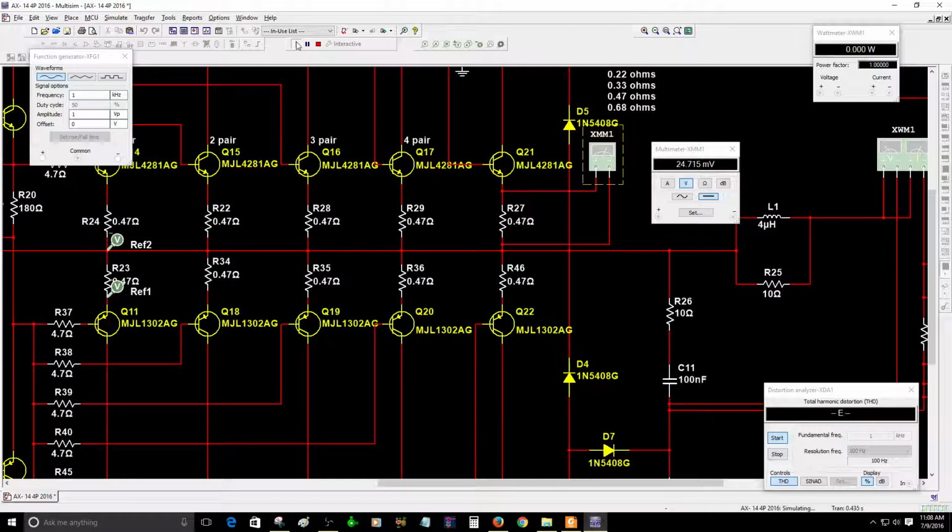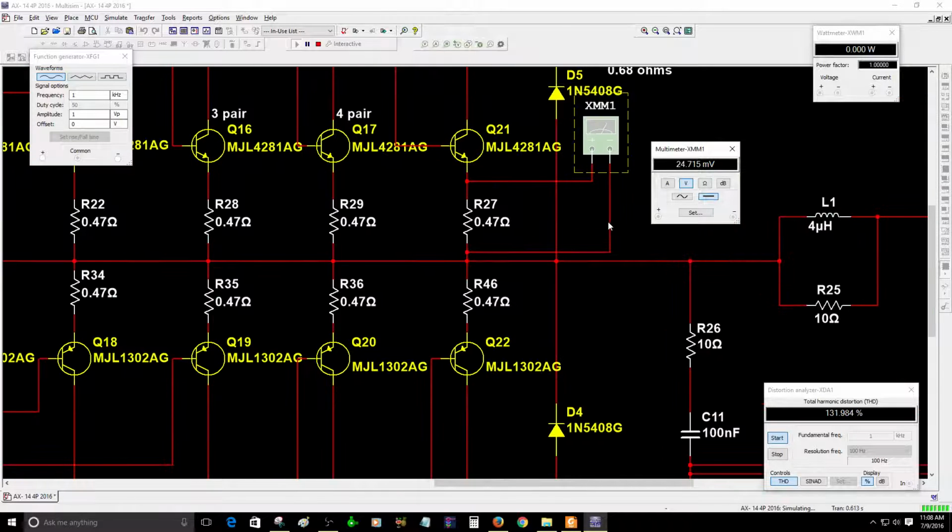So right now, he recommended for Class A/B operation on this design, to have a lower crossover distortion, 47 millivolts, but this is one way I do it, reading one particular emitter resistor. But actually you can measure it this way too.